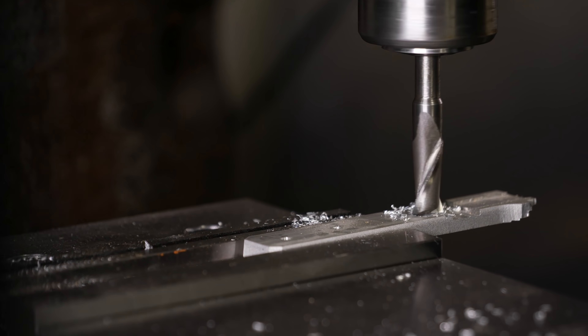Overall this thing does work like we wanted it to, although I've already found several things that I think we can do better. The geometry of how the pieces are attached to the arms themselves needs to be adjusted, and I think we can find some ways to add more tension to the whole system so that it will lock in place a little bit more. Plus the trolley needs some work — the part where it's connected and spins around is kind of weak and needs to be more robust. Anyway, we've got a whole bunch of things we can do but this is a great first step. If this gave you an idea of how to make something to make your workspace better, let me know down in the comments. We've got tons of other projects you may want to check out, and if you're not subscribed be sure to do that. Thanks for watching — we'll see you next time.